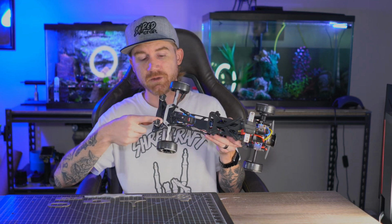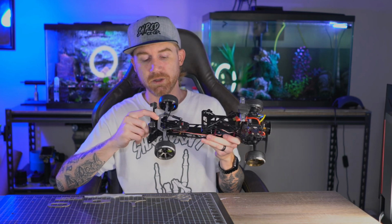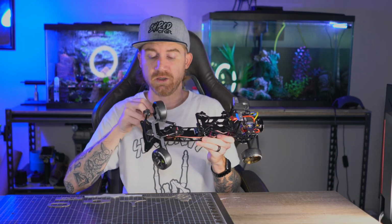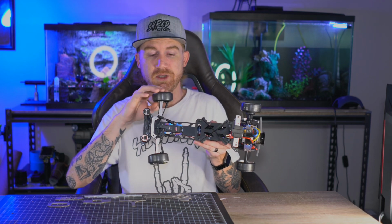And then obviously you can see the top arm here is just a piece of aluminum, so I could test the design and check the wheel cutouts that I had made for clearance to see if that's going to be beneficial or not. I also made the lower arm, but the problem with this one is my distances between the top two holes were off a little bit, so I'll have to go in, fix this file, and then we'll try it out.